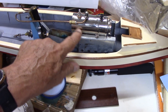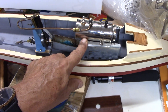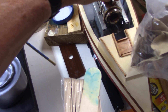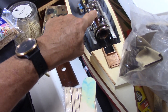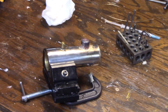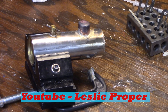Although I might use this at a later date and make a different firebox, because it's a very nice little boiler — I think it was about $40 plus $4 shipping. One of the features is it has a sight glass for your water. This fill tube here is 6mm. The whistle is something different — I used a grease zerk that I re-threaded here, and I'm not sure it fits right. This looks really nice now with the solder recommended by Les Proper. Les has a really nice YouTube channel with beautiful work on really miniature steam engines. Check him out.